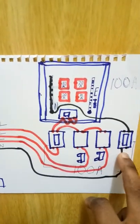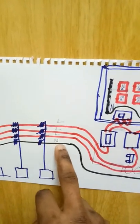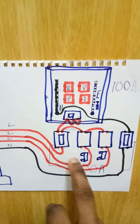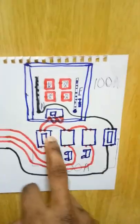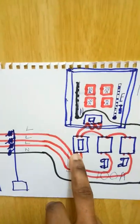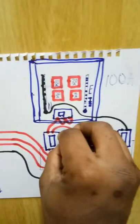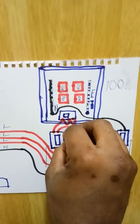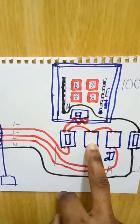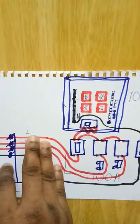The neutral cable comes down to its cutout fuse. Since you are using one single phase, you never put all three fuses together — you remove the fuses from the other two. In case one line has low voltage, you can remove the fuse from there and try the second line. If the second line also has low voltage, you can remove it and try the third line. The essence of bringing all three phases down is so you can choose one phase at a time.